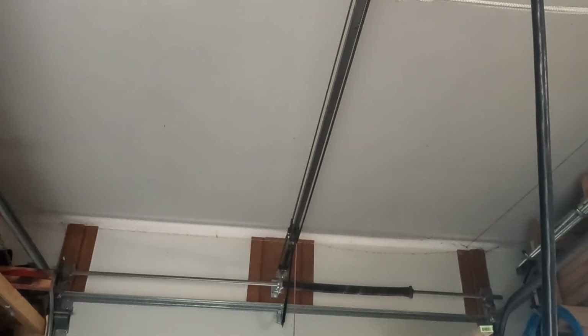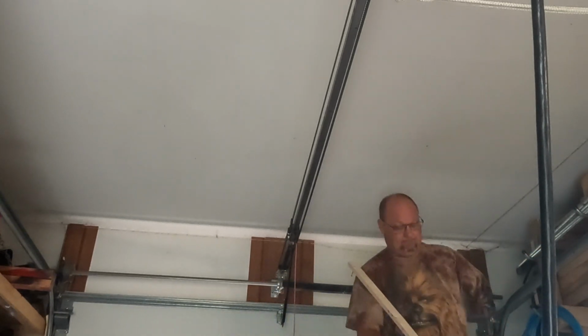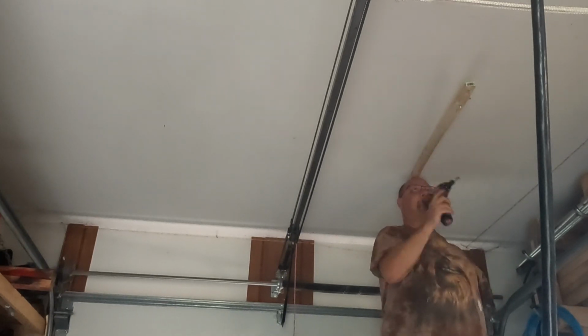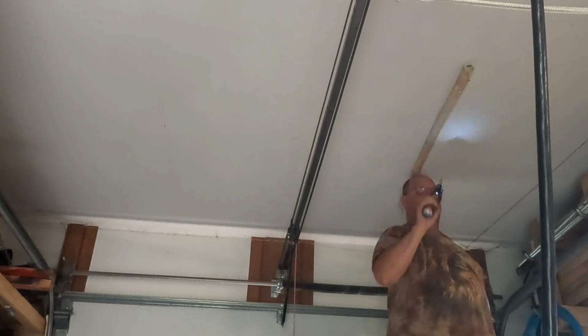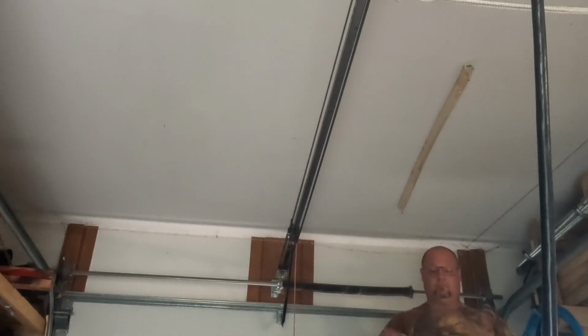So you see the screw is sticking out way too far. I put that right on top of a mark where my ceiling joist is, and I already have it screwed into one ceiling joist. Then all I have to do is align it and shoot the other 2 screws into the joist, and I'm home free. You'll notice that I intentionally chose a furring strip that was extremely warped to show that it pulls flat when you screw it to the ceiling.